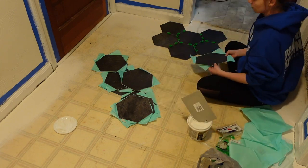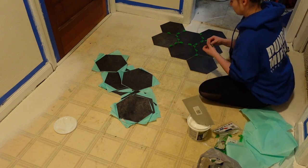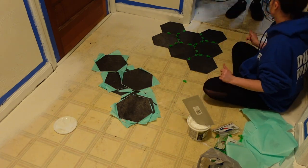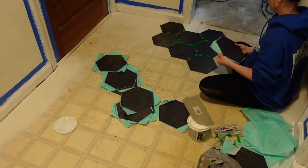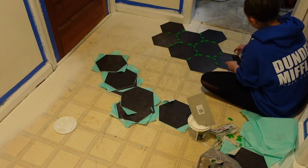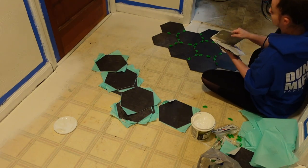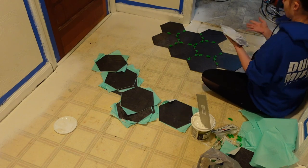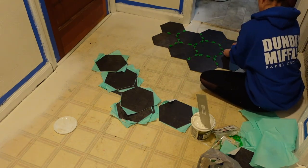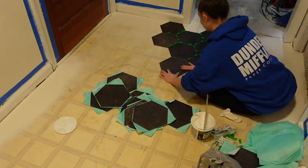I did let them sit for 24 hours and I think it helped a lot. Then I'm just putting my tiles down and putting my spacers in. I use one-sixteenth inch spacers and I probably went through like four bags — I wish I would have gotten like five or six bags, but it's totally fine.